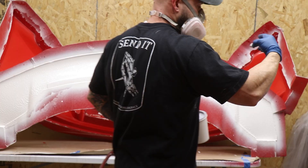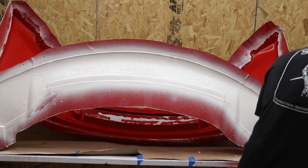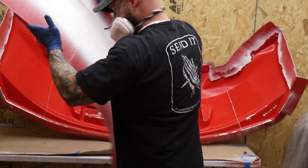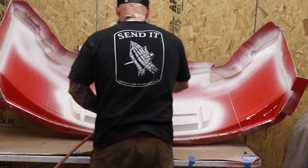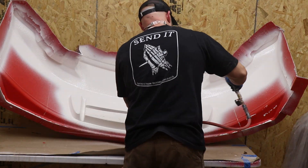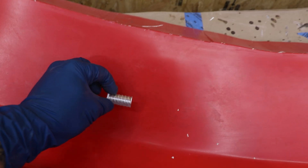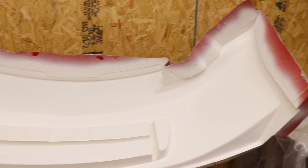This worked out perfectly this time. It's very important that we spray the gel coat — you want to shoot for a specific thickness, in this case somewhere around 20 to 30 mils. Some people recommend layering five mils at a time. I'm going to lay this all on at once, and you can measure it using this tool. You simply spray it down and dab the tool in, and it'll show you exactly how thick your gel coat is.